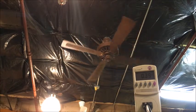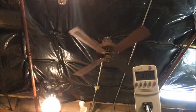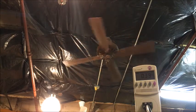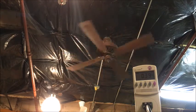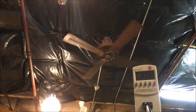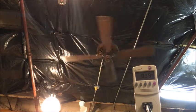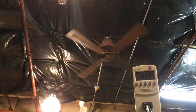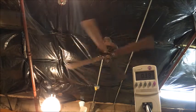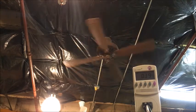And just a hair over what it does on the variable low. So that's 8. And that's a decent low right there. That's a perfect low. That's 8 microfarads. Right there, beautiful. I like that. If I were to just do a straight high on it and use a wall control, this would work for low. Here's 9.